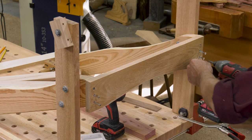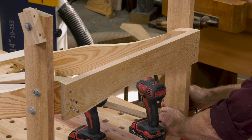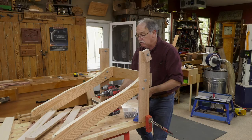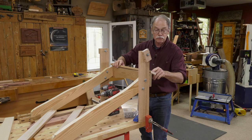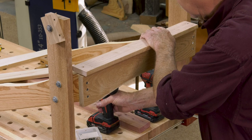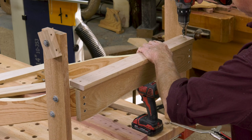Now I can drive screws into the square cut on the front of the leg assemblies. I'm using the workbench as a jig to hold the legs — you can see how they're clamped. That's solid and gives me perfect spacing. These impact drivers are great tools, but you don't want to over-torque things. Keep it square and flush with the front of the bench. Everything's flush. The next thing is to bring up a bald cypress seat board that has the edge rolled over and is already counter-bored. I balance it left and right, then drill just one hole to begin with, keeping the spacing just right.